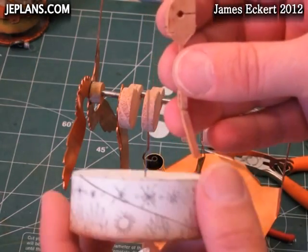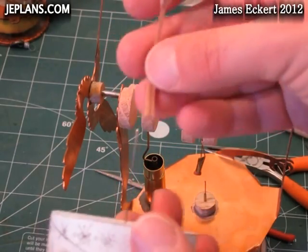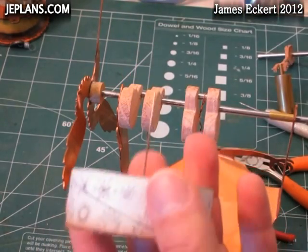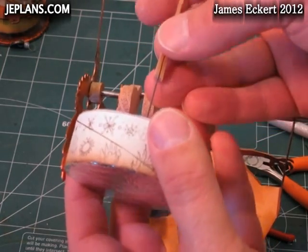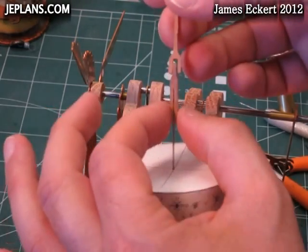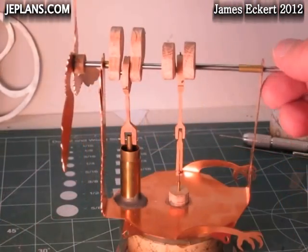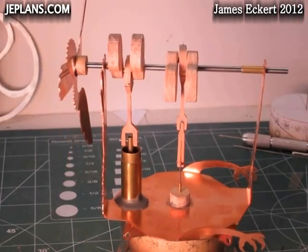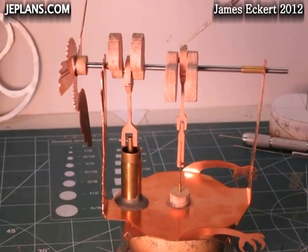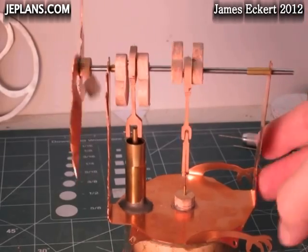In the case of the displacer connecting rod, the top part works the same — same pin configuration on the bottom. It'll basically go around like that; it might have a little strap or something to hold some tension there, and that'll drive the displacer. Once it's all hooked up it'll look something like this. The top part of the connecting rod — you may need to clean it out a little bit with a round needle file so it runs with pretty low friction.